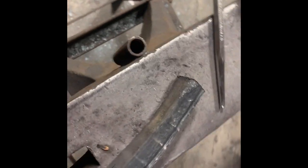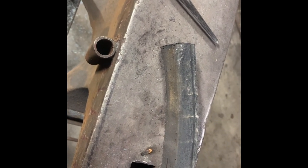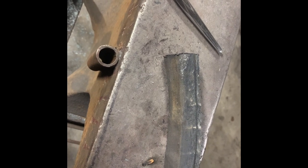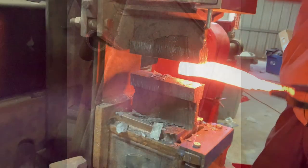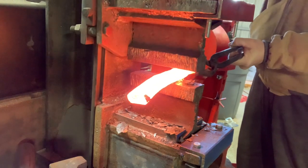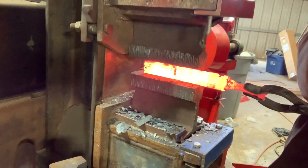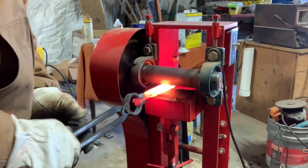The white paint worked. Got it out of the can and it came out pretty easily. I got a little too aggressive with my cutoff wheel and scored the top of the billet a little bit. I'm just going to heat it up really good and go ahead and forge it down to billet size. I'll use my log splitter press and smooth it out with the roller mill as long as everything's looking good. I'll keep it at or near welding temperatures the whole time I stretch this out. I already had it pretty much to the width I wanted out of the canister, so once I get it pressed down I'll take it to the roller mill, which stretches it without widening it — which is always handy.